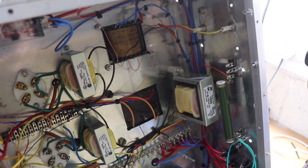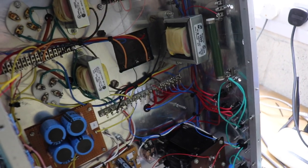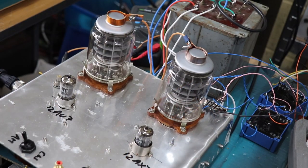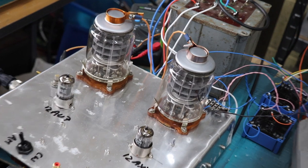That's the underside of the power supply and so far it seems to work — no major problems. So now I'll show you my highly lethal test rig of a modulator. As you can see, we're using a pair of Russian GU72s — these are powered tetrodes. You could ask why I'm using GU72s as opposed to 813s — well, I've got a couple of these in the shack. The advantage is they can tolerate quite a high plate voltage, similar to 813s. They look quite interesting actually — they've got a waffly-shaped anode which is a little bit unusual.